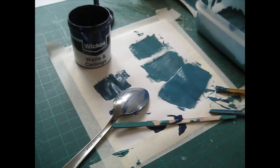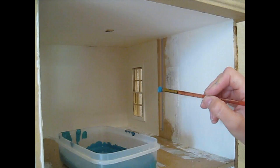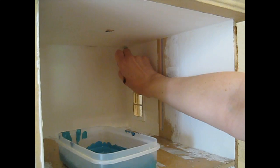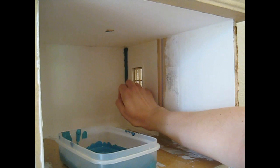I'm starting with a smaller brush to go along the ceiling and around the window, then I'll come in with a larger brush. I've got a little bit of leeway because the coving will cover any paint I get on the ceiling, and the back wall will be papered. I may have to move the camera to get in properly around the window.